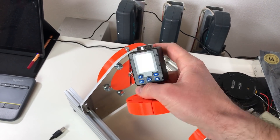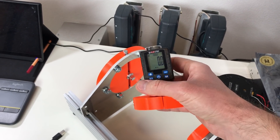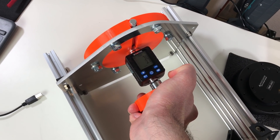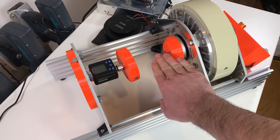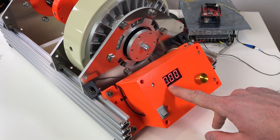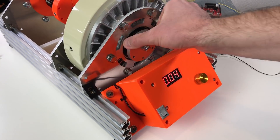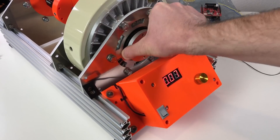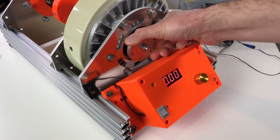Over here is the piece you use for the wrench to measure the torque. The idea is to fix our actuator between this part and this part. Let me show you how the electromagnetic brake works. Now the current is set at zero so the shaft rotates freely. When I put some value, I need to apply significant force and can hardly rotate it. And if I go back to zero, it rotates almost freely again.